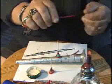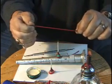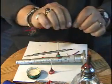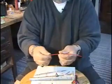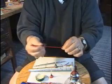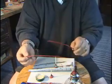I have a special injector in the basement where I can formulate a wax to be really soft or really hard. By mixing different waxes together, I can get the kind of wax that I need for whatever I'm doing. These particular shapes were generated just like a cake decorator, where you're squeezing the wax out of the end of a die, and it squeezes the wax out into the shape of this wax wire. I have big ones and little ones. Here's a little bit bigger wire.